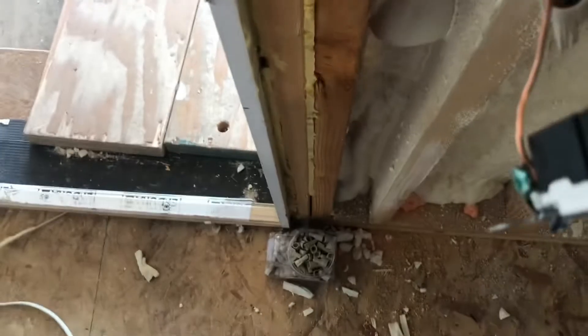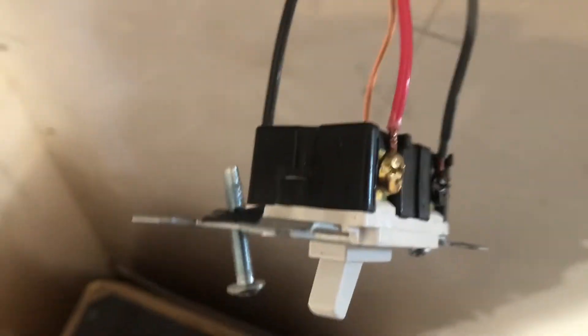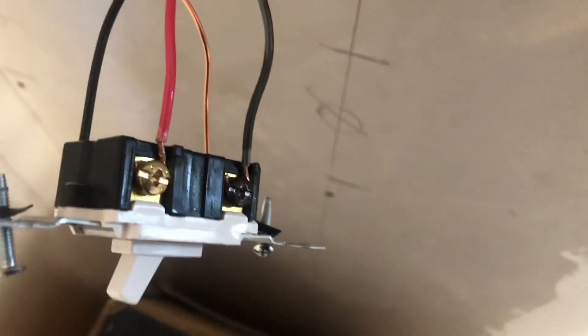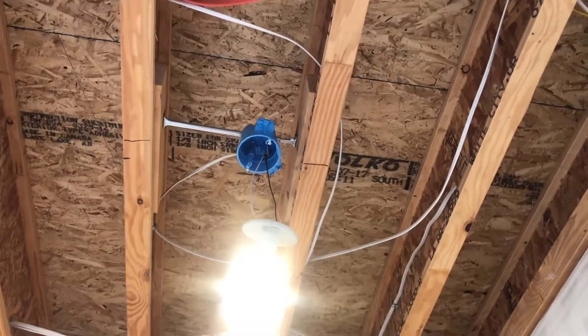This pair of black and red from the 14/3 wire goes up, and it doesn't plug into the light — it goes to this other switch first. That pair connects here, and then the black wire here goes up into that light fixture right there.